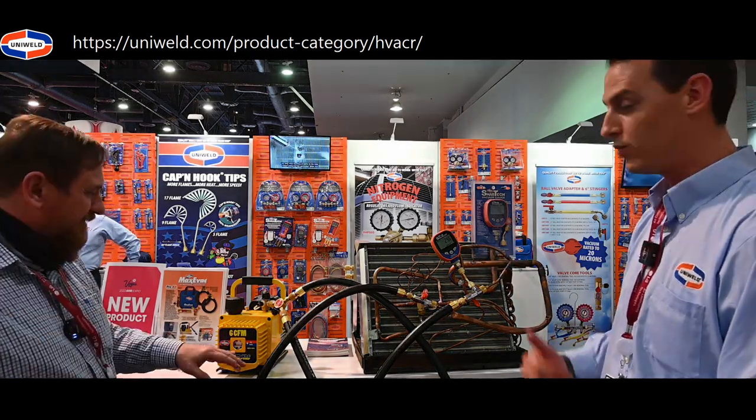I really appreciate your time. What else do you have to show us? So in our pro kit you get two six-foot half-inch hoses. On each end of those hoses you're going to have a quarter inch connection on one end and a three-eighth connection on the other end. The quarter inch will attach to your core tool, and the three-eighth is going to attach to that Y adapter and give you the dual hose connection on your pump. Want to turn on the pump and watch the micron reading drop down? Is your oil in good shape? It is in great shape - as you can see we've got perfectly clear oil in there ready to go.